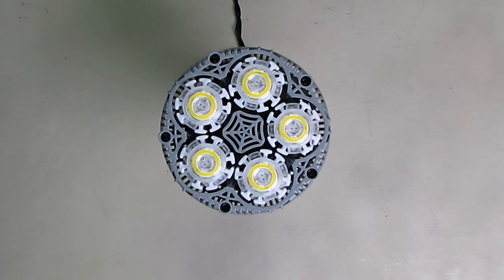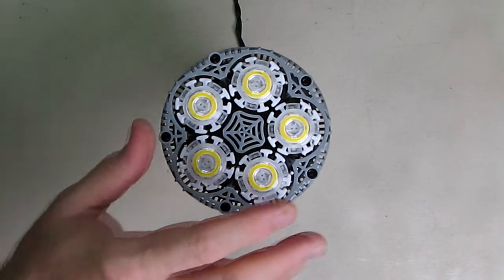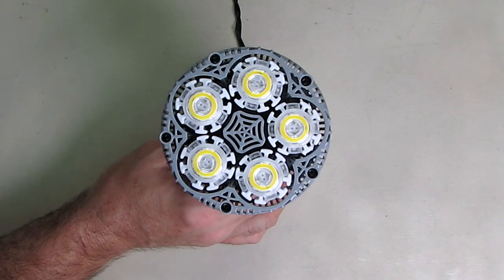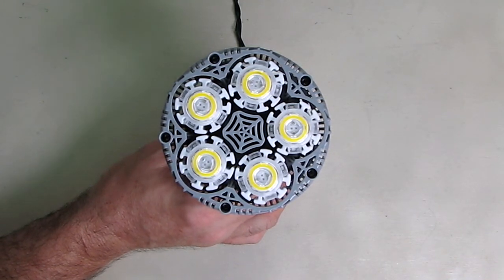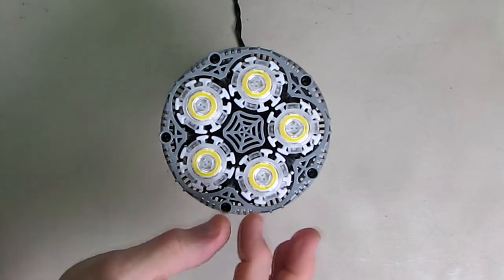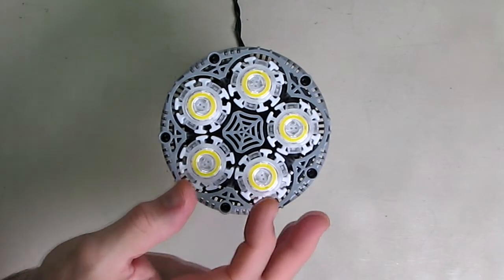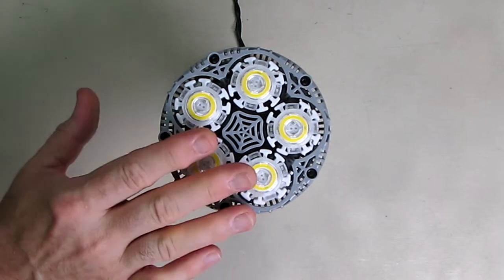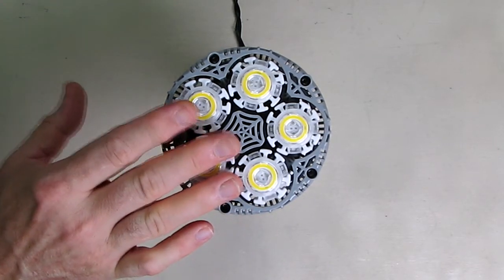Pretty incredible. So the efficiency, or the lumen efficacy, which is an important number, is 130 lumens per watt. And that's incredible because when LEDs first came out, the efficacy was about 80 to 90 lumens per watt. So now they're getting to the point where it's 130 lumens per watt. That's telling you how much light output, lumens, per 1 watt of power. That's giving you the efficiency of the bulb, and that's very efficient. And this works with standard 120 volts, 60 hertz.